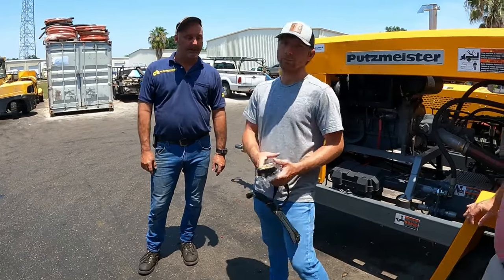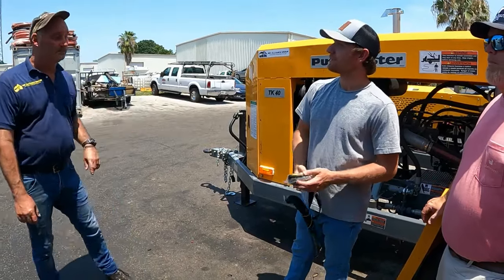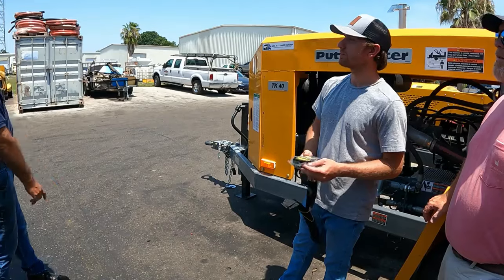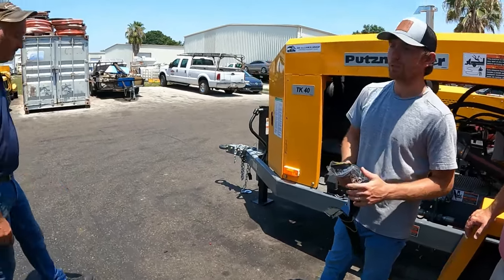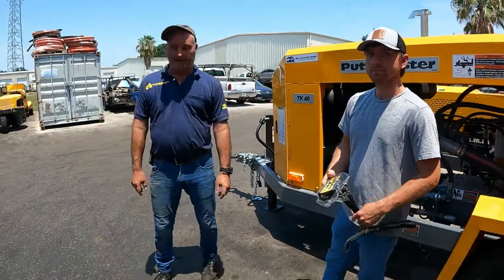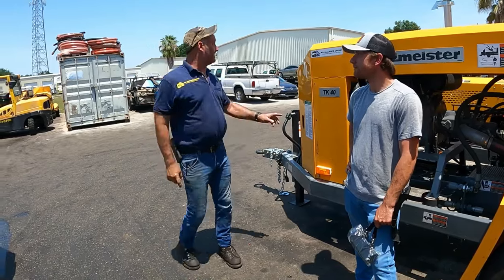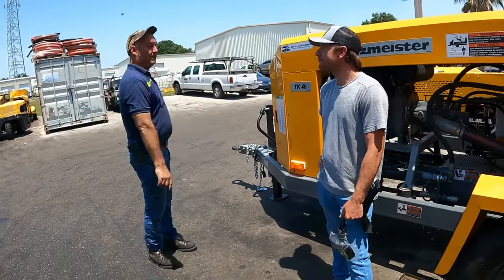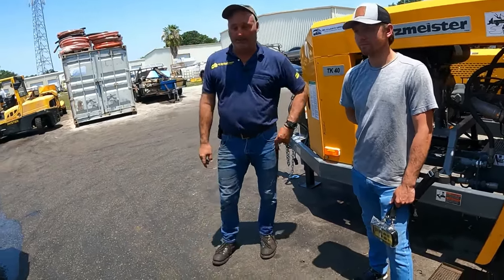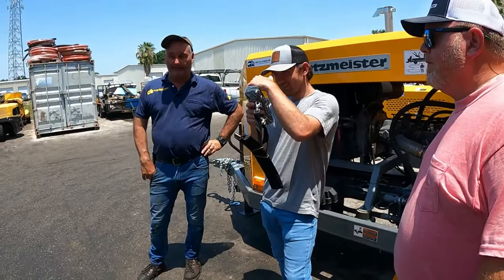They drop pretty drastically. But this isn't the one that he was talking about. He was back over there behind us, way down there. Yeah, the same one. That's probably 650 feet to the Concord Drills. So we got to the lake. To the lake, correct. Yeah, they're pretty efficient. But that's line of sight too. That's when you see them down the road and they're taking the machine down that way and I'm going this way. So that's line of sight. When you start going through a building and through levels of concrete, it drops pretty drastically. Yes. On 900 megahertz, they don't penetrate too well.